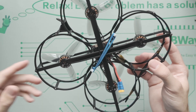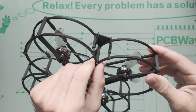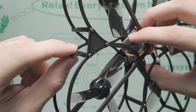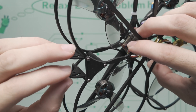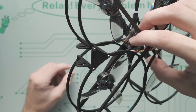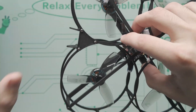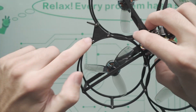The FPV mount needs to be improved. The mount doesn't have enough room or material, and things look different in CAD when you're zoomed in close. These parts also need to be printed in TPU. But otherwise I think that portion would be okay.